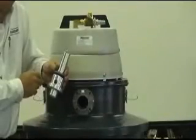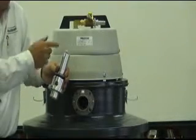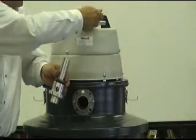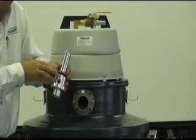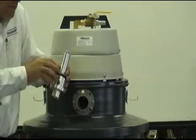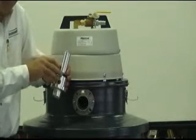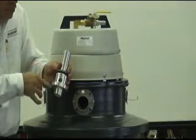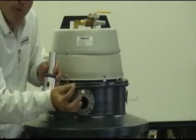Now we all know how vacuum is created with an electric motor, but how are we creating a vacuum with these air units? Once we hook our air line up to the quick disconnect and open the flow of air, air rushes through this valve and then exhausts out just as quickly. But in this center portion of the valve, a venturi is created — a tremendous amount of compression and vacuum occurs. We take that vacuum, channel it through the intake, and voilà: tremendous vacuum with no moving parts.